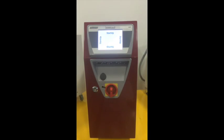When starting the unit, you will switch the main switch on first and wait until the software boots up. The software boots up automatically and it isn't necessary to press a button on this start screen. After this approximate 120 second wait, you will be brought to the main screen and have the ability to press the power button to turn on the desired temperature control circuit.